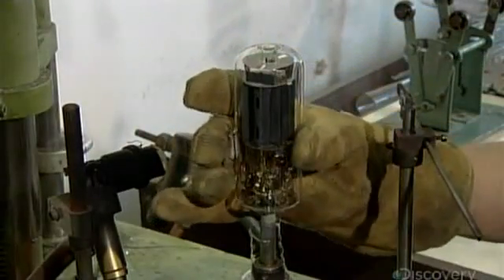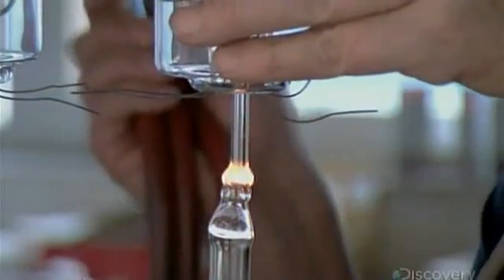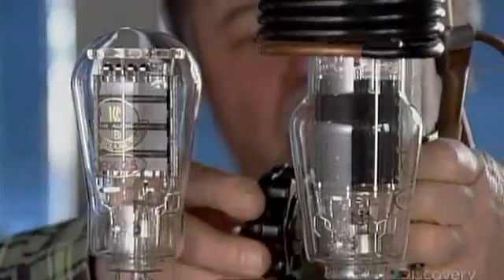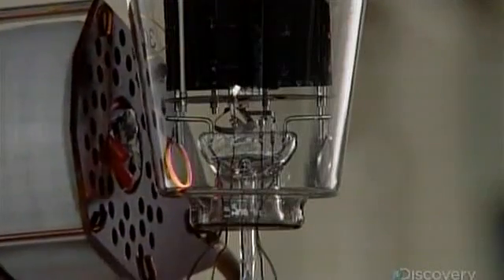Next, they prepare to suction out the air. This step is critical to the tube's performance because air molecules hinder the flow of electrons. Technicians fuse the tube's evacuation port to the glass evacuation line of a vacuum pump. The pump then extracts the air through the port. At the same time, they heat the tube in a pull-down oven. This increases pressure inside the tube, creating a stronger vacuum. Next, they run an inductive heater over the tube. This dislodges damaging impurities, enabling the vacuum pump to draw them out. They target the stem area with a second inductive heater to draw particles called ions onto the glass permanently so that they can't later damage the tube.